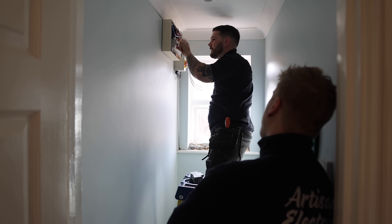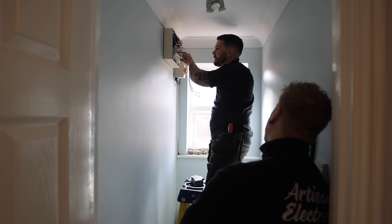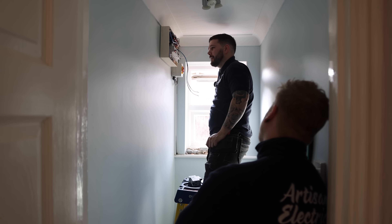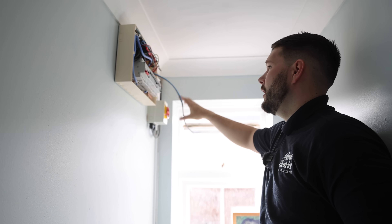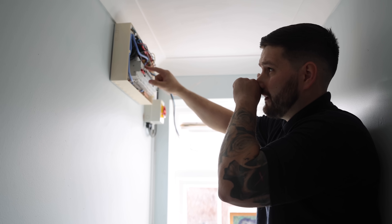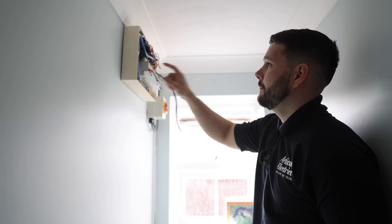So this is a bit messy. I was going to take out this 80 amp and swap it over. Does it have to swap with the 80 amp or can it swap with the 63 amp? We've managed to get the 4mm through and fit it in the trunking as well. I've brought it into the board here. We've just put in the 32 amp breaker for it. Now we're going to swap the RCD because it's an 80 amp and they've supplied us with a 100 amp. I'm just going to have to fight all these cables and the CT clamp to take the old one out and put the new one in.